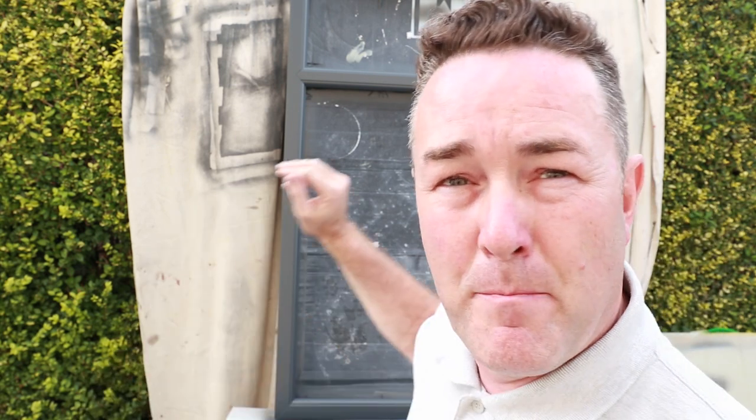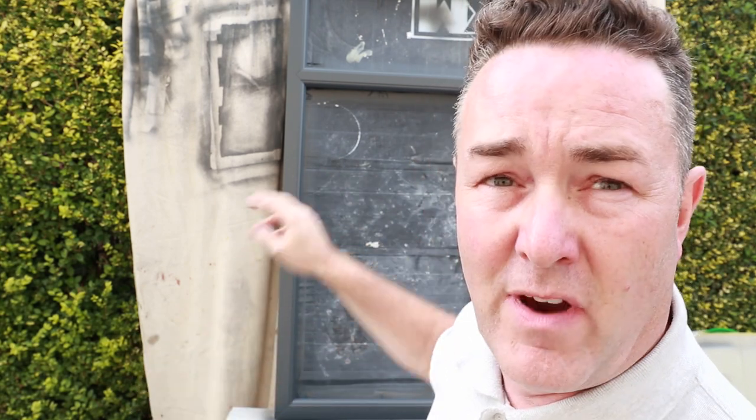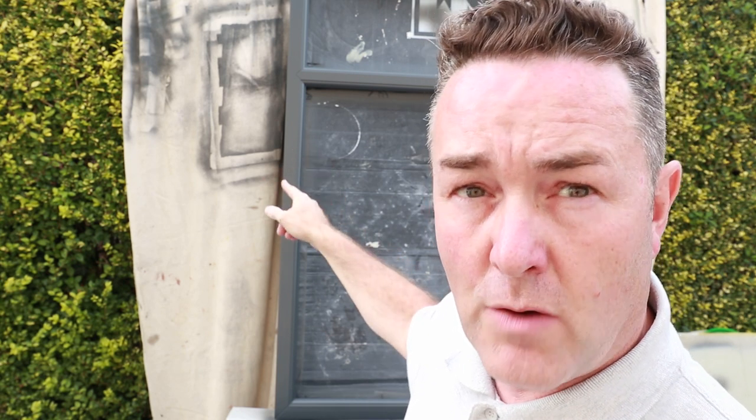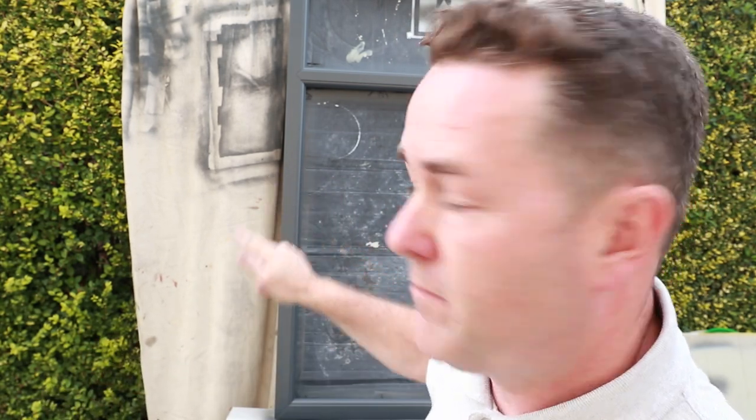I have to say, Simon was right at Kolorbond. When I did it last year, I needed to put a splash of water in it to get that mix of paint and water, the atomization with the airflow, to get a nice coat. It's actually been a lot better with a splash of water. Its actual coverage flow has flowed out nicely. Now I gave it three top coats over a mist coat. I didn't need that, because it had actually gone nicely with two top coats over the mist coat. That's by the by. I can give it another one if I want.